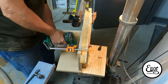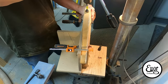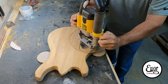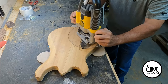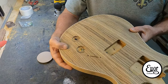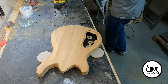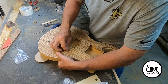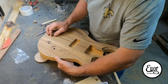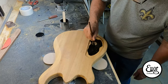Now I'm setting up at my drill press with a little jig to hold the body in place while I drill my output jack hole — that's a seven-eighths inch hole. The jig really helps keep it nice, straight, and well aligned. Since this is a carved top guitar, I can't get my final depths for the controls until after the top has been carved. Now I've got to route out the back to get the thickness just right so the threads on the potentiometers and the blade switch screws fit properly. I always do this fitting and testing at this point so I'm not messing with the finished guitar body. I touch up the shielding paint in the back and it's ready to go.